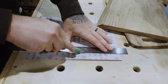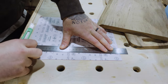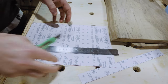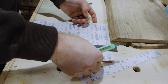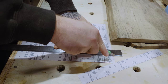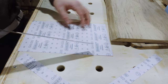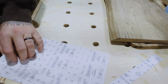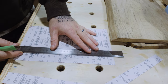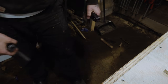Cutting sandpaper grit side down makes it hard to move after you cut it, which is making me look like a total amateur — in reality, I am. Hopefully people that get these charcuterie boards don't know that. These little paper strips are 220 grit, and I did some at 320 grit. I cut these so that I could get them inside the handles, because sanding the faces and edges of the charcuterie boards is pretty easy, but getting inside those handles was proving to be a bit of a challenge.